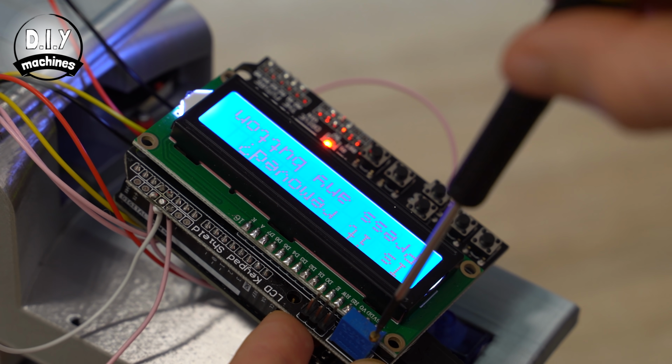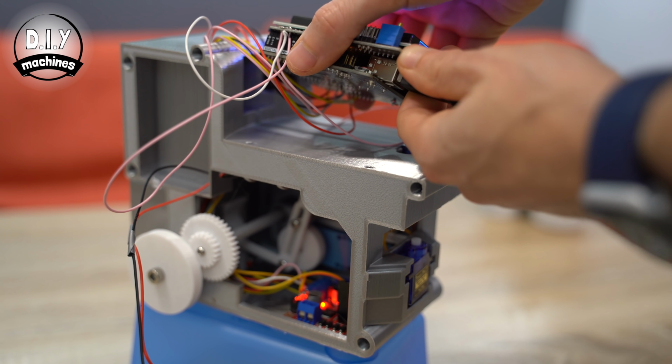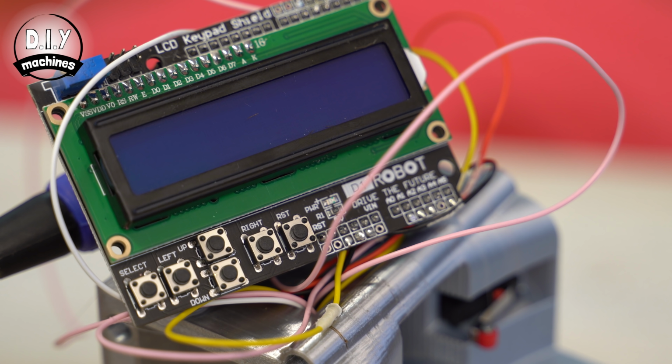It may take a lot of turns before you see anything happen. Just a quick word of warning, it's bad for the health of your Arduino to connect it to both a 5V power supply through its 5V pin and the USB port at the same time. So when you want to connect your batteries, disconnect the USB cable first and vice versa, and you should be just fine.